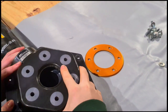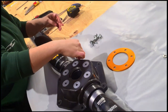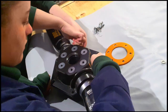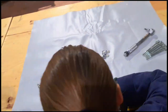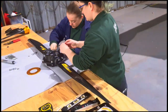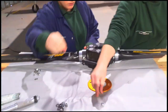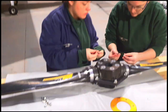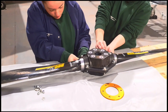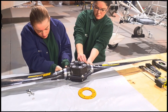They're going to lift the blades up so they sit in nicely — we're now going for a rough assembly, so they're going to be putting in the edge bolts. Whether you've got a 2, 3, 4, or 5 blade, it doesn't matter — it's the same procedure. Just take your time; don't over-tighten anything at this point. Get it all roughly assembled.